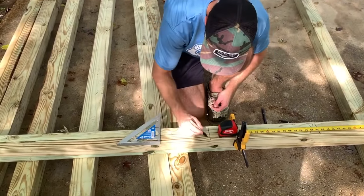Now, you can see here that I have a shop vac close by, and the idea is that the shop vac will suck up any of the pigment powder that ends up escaping instead of it going up in my face and me potentially breathing it in. And I'm also wearing a respirator right now for protection as well. So continue to mix in all the pigments. You want to mix until it's completely homogeneous and there's no streaks in it. This can take a few minutes, but we eventually got there. So once your Clear 100 Part A epoxy has no more streaks in it and the pigment is fully dissolved throughout, you're gonna close it up and let it sit overnight until we actually mix it with the Part B. So seal that up and now we'll move on and mix up our darker pigment.